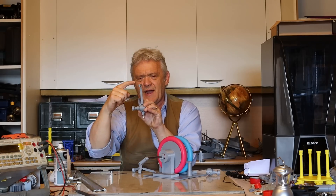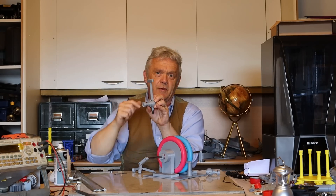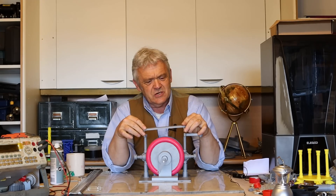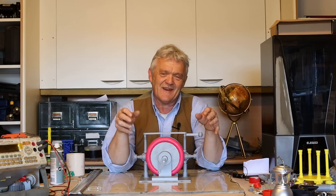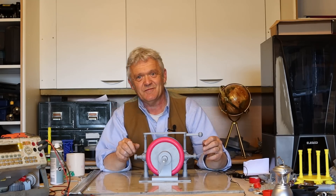You're going to make sure that that is 90 degrees to that, so that when that's moved, it moves that. We take the bars with the smaller holes, get some 6mm pegs in there, and they slot into that section. We slot the other side in, and that's our steering parallelogram. When I move that handle, both of these are moving in the same direction at the same time.